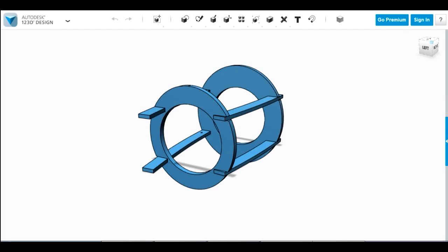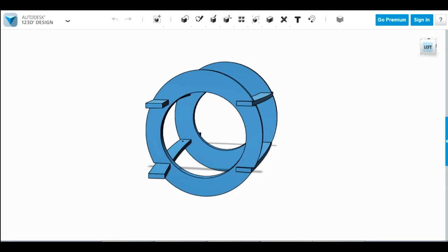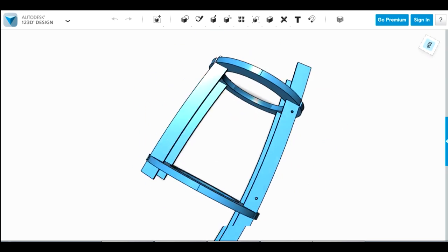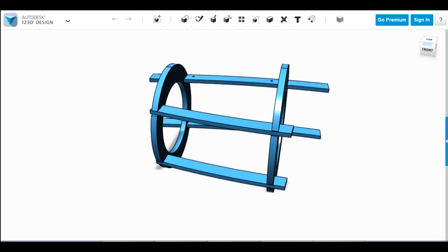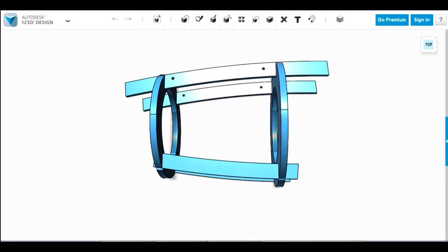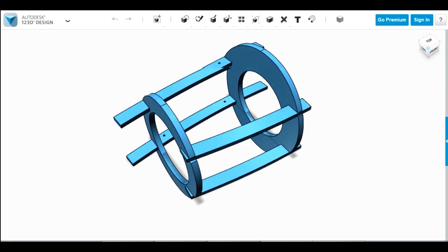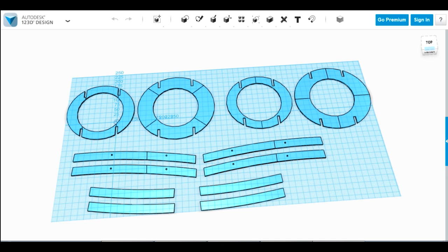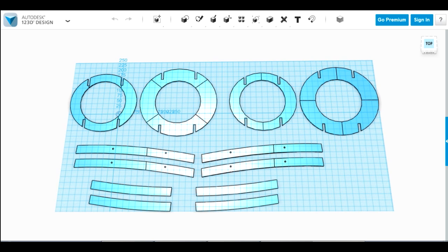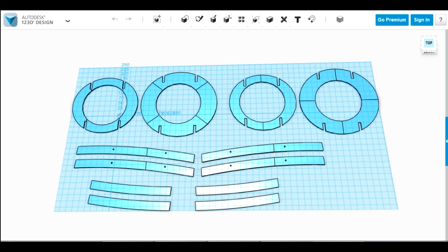I've decided to plan the forearm structure before mounting the hand to it. I've come up with a design that's basically two loops — a bigger one at the back — making the main forearm shaper to replace the existing ones. I've put hinge points in and I think what I'll have is a four-bar link with offset lengths, so that the back of the hand plate flips up and outwards, similar to the shoulder pods, flipping the hand back slightly to reveal the repulsor. This is quite a big part, divided into quarters and longer sections with overlapping seams, and needs to be printed twice for both arms.